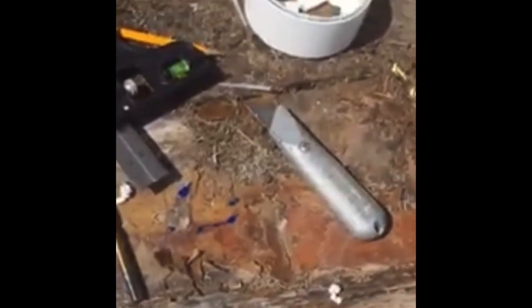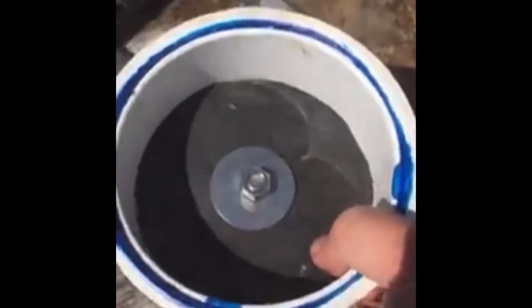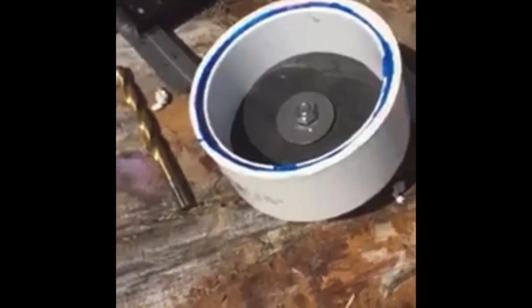You don't want it too tight, because if it's too tight, as you can see, it won't move. So you want it just tight enough that it can move up and down. See how that is now down? It needs to move a little bit. Now the water pressure when you pull up is gonna suck that gasket down and keep it down against it, so you lose very little water. So let's find some water and I'll try it out, and then I'll glue it up to the end of my pipe and we'll be ready to try.